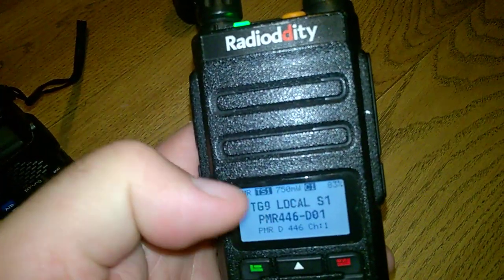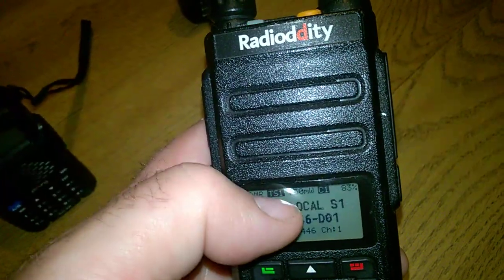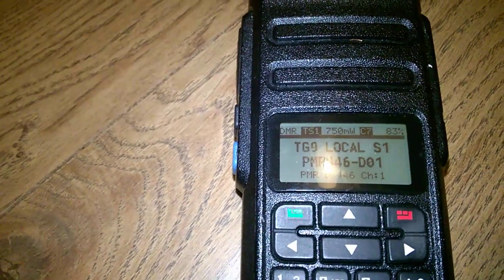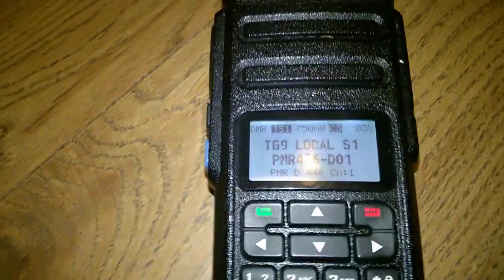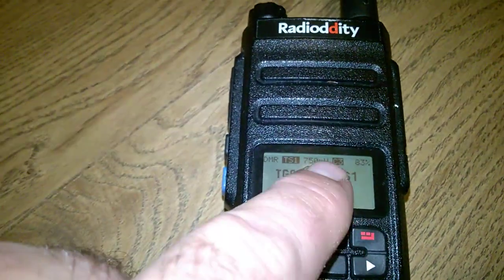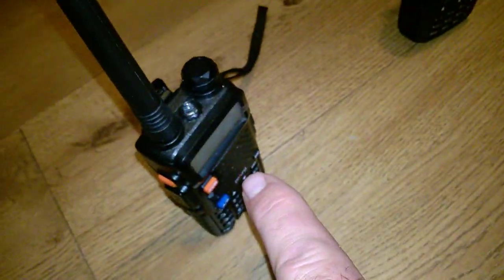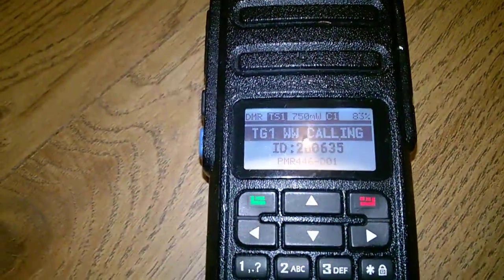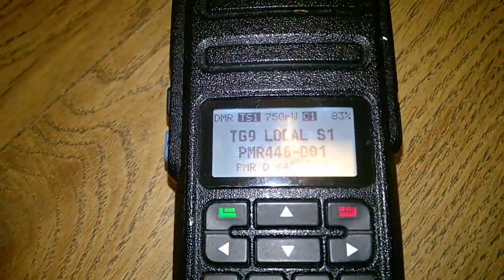You see the black bar around it — on time slot and colour code the black bar means the filter is off, and on DMR it's the opposite way around for some unknown reason. Anyway, if you notice it's listening on CC1 — Test 1-2 — but when it actually receives, it switches to colour code 3. So that radio there is on colour code 3.